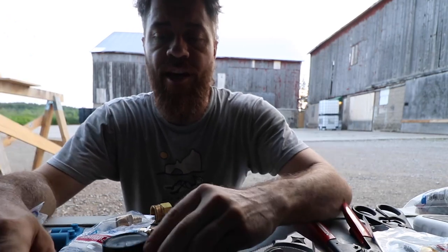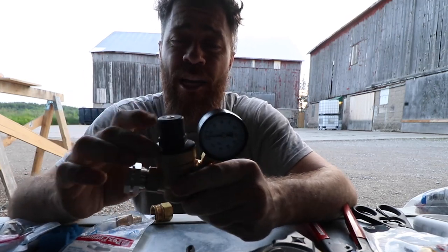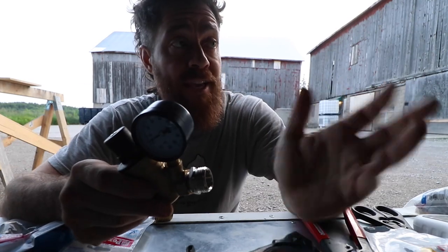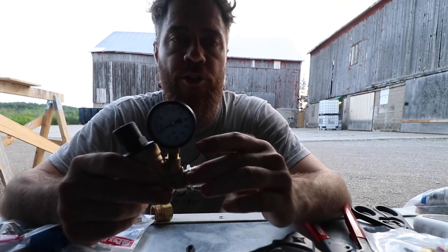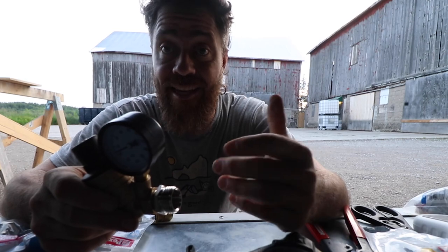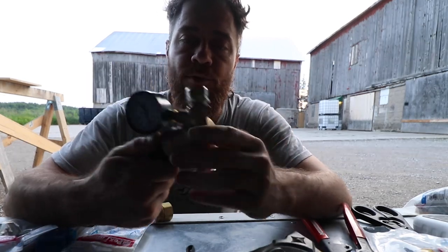Next up with this recirculating shower is we're installing a pressure regulator. What this little device does is it's got a screw here on top and you can actually change the pressure on the incoming side to the output side. So if the supply pressure is too high, in this case, the Webasto can't have more than 36 PSI of pressure, but the pump pumps 45 PSI and you can't adjust the output pressure of this particular pump that we're using because there's no pressure switch, then you have to have a pressure reducer like this one, a pressure regulator.